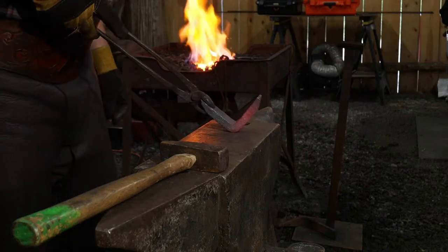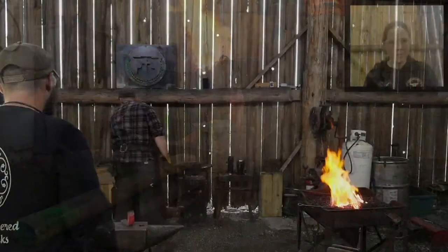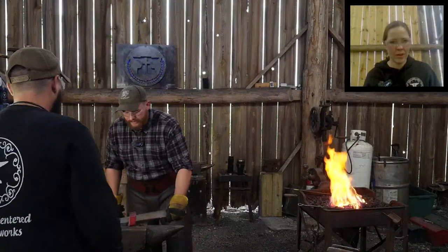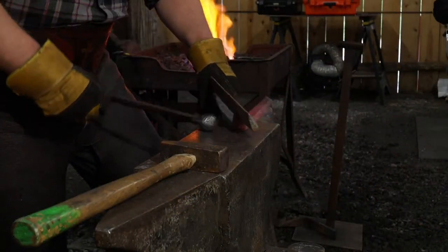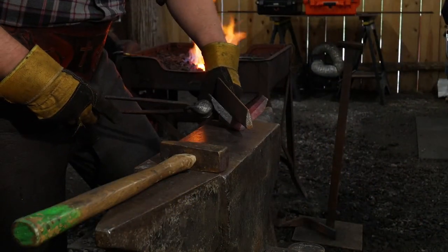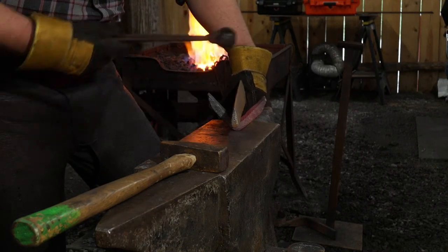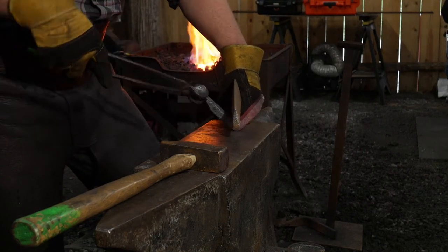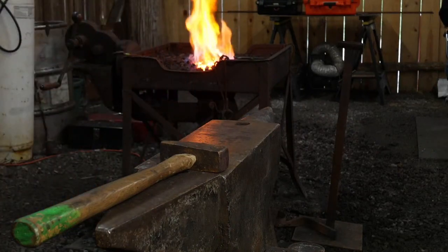You can see we got that so far, right? So that's going to become, you can keep there, Jess. That's okay. Going to become the back of the wrap of the axe. That little bend that's already there, we're going to take advantage of that. Some of our work's already done for us when we wrap it around this drift here. More on the drift in a bit.